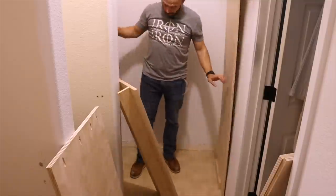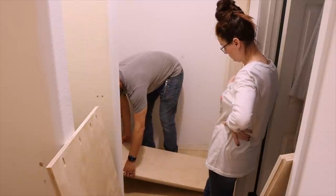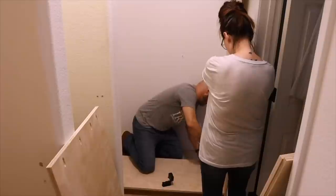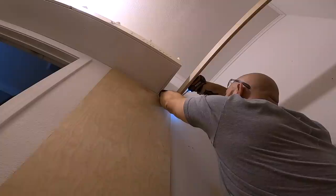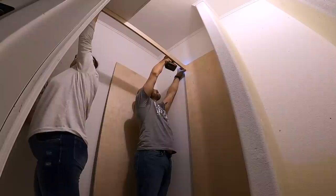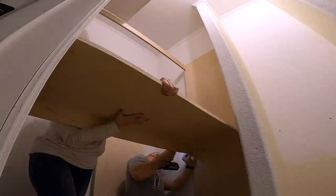What I did was put a three-inch strip on the bottom to support the sides of the bottom shelves, then brought all the pieces in individually. Here you see the bottom shelf with the toe kick already attached — just use wood glue and brad nails to hold it in place, it'll be plenty strong. For the top and middle supports we're going to install those in place using inch-and-a-quarter pocket hole screws from the back, so when it's slid against the wall you don't see the pocket holes.